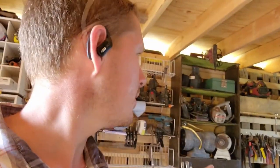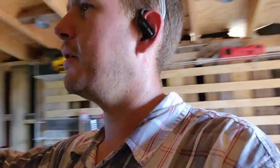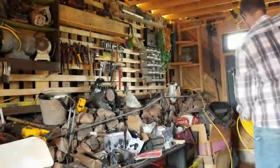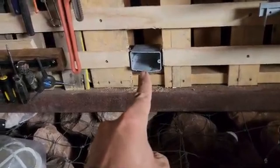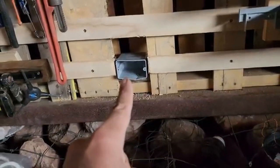Next step is pulling wire. I've got a bunch of 12 gauge — I'm going to use 12 gauge for our outlets. It's going to be a bit of a weird run because I've got to go from our breaker box to the outlet down here. One thing that would have been smart was to punch the knockouts out before I put them in the wall — I can't get to them very easily, but we're making do.